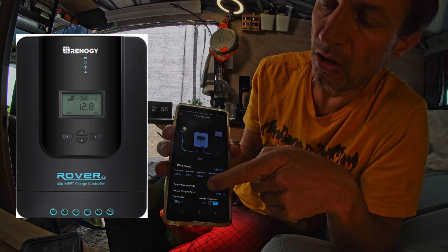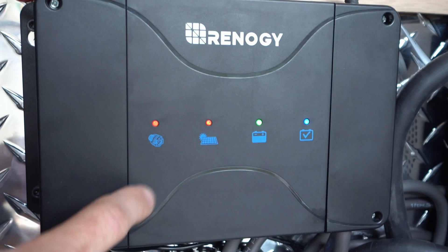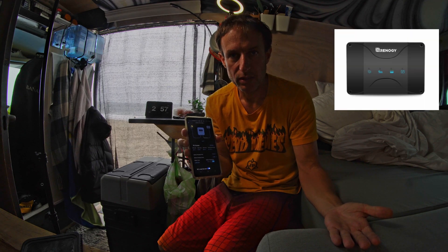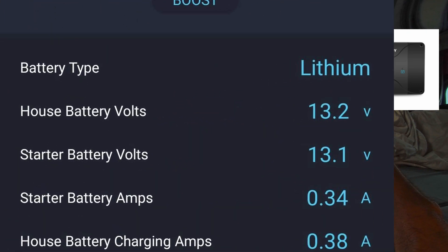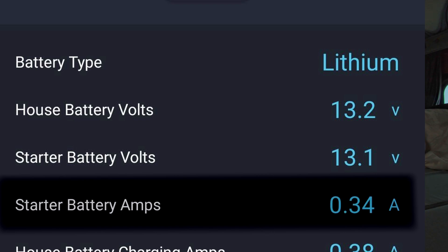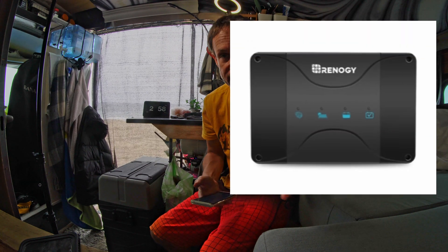The Rover gives you all kinds of data. I prefer Rover over the DC to DC — you can plug higher wattage panels into it. There's a 25-volt limit on the DC to DC and it doesn't have a screen. The DC to DC portion rarely produces 25 amps; sometimes it won't even do one amp. I can't seem to get Renogy to do anything about it. What they tell you is to reset the system every time, so people put a switch on the panels and battery and totally disconnect the unit every time it stops producing power, then reconnect it.